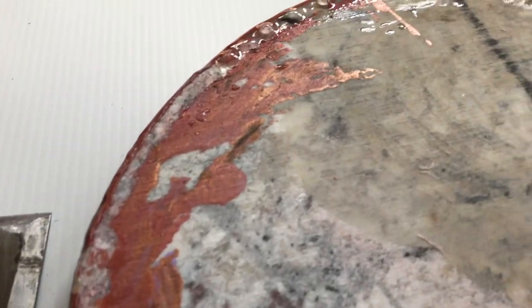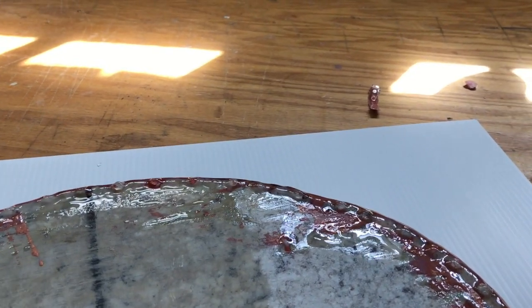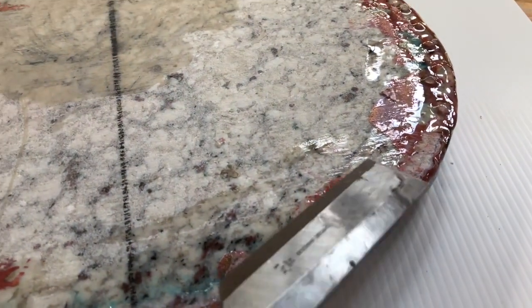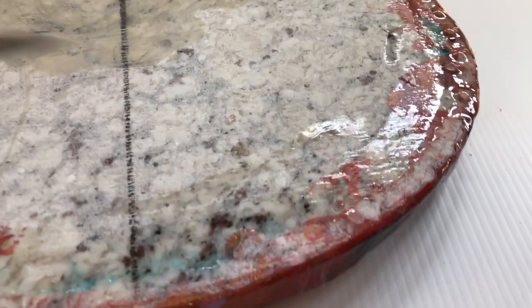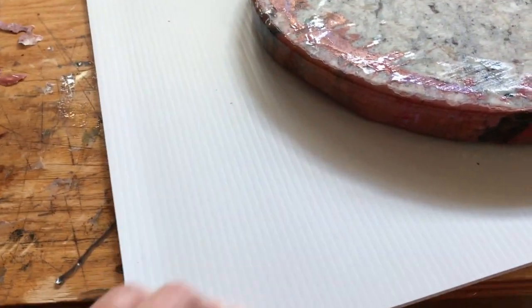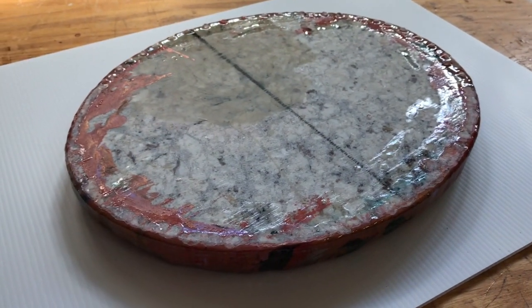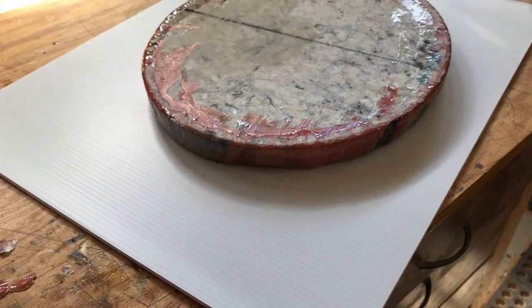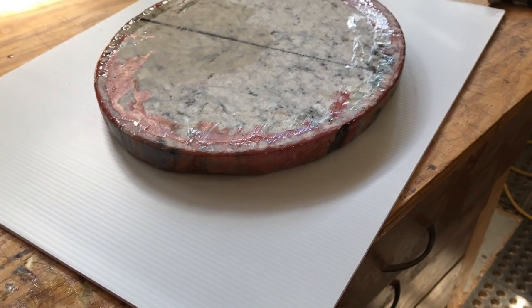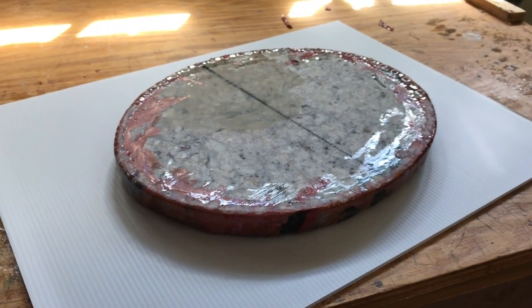I'm trying to get the chisel at a right angle to grab these bumps but not dig into the granite — digging in is inherently going to be a problem. I've also got this flipped over onto a material that doesn't want to grab the resin. Even though the resin is dry, I still need to be careful. I've flipped pieces onto cloth prematurely before and ended up having to sand it all down and pour another coat of resin, which really isn't fun after you've spent a lot of time getting it looking good.